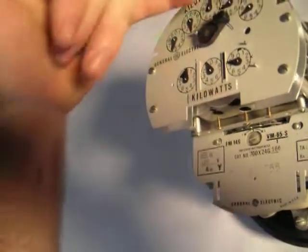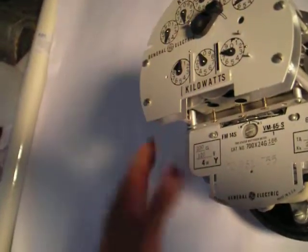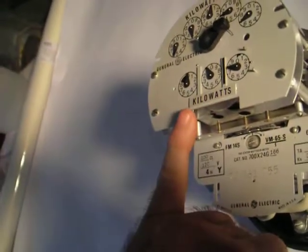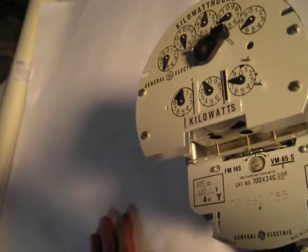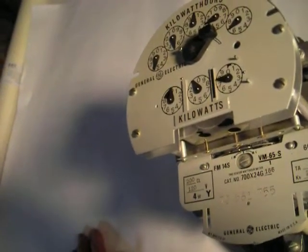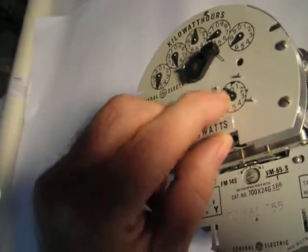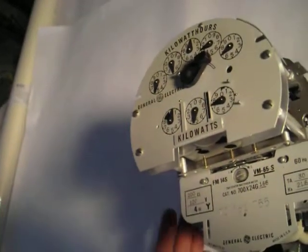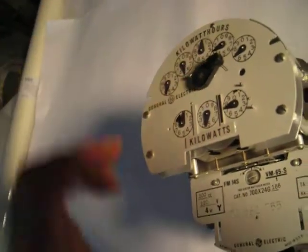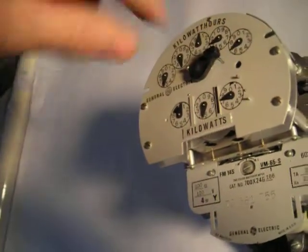That extra charge is because they've got to have bigger transformers sized for your peak. The billing scheme looks at total kilowatt hours for the month like a normal home meter, plus if you use too much at the same time compared to your average kilowatts, it dings you more. For example, a continuous load like street lights is predictable and they know how to plan for it. But if you turn on a giant 100-kilowatt motor for an hour, this thing measures 100 kilowatts, and if you don't use much the rest of the month, you pay a higher rate per kilowatt hour because they had to size a transformer for that peak load. During the meter reading, the reader resets all dials to zero through the glass globe.